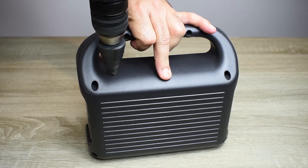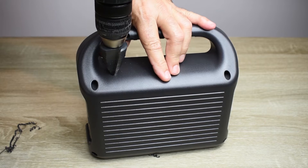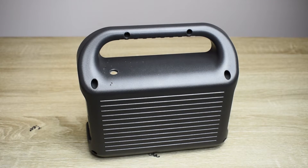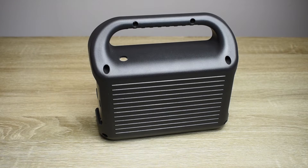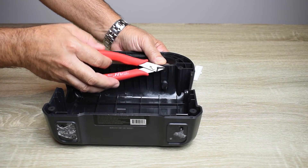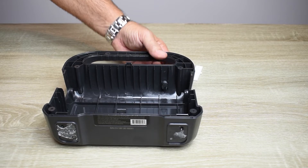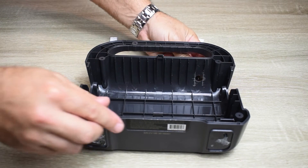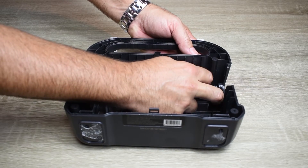To drill a very clean hole in the plastic, you're going to want to use a step drill, also known as a unibit. I marked it right over there and drill it very slowly, keeping a close check on the size. And as you can see, that fits perfectly. On the back side you have a ridge in the plastic — in order to tighten down the nut securely, I'm going to take cutters and just trim away the ridge so I can put the nut on. The plastic has been cut away and it's nice and flush.